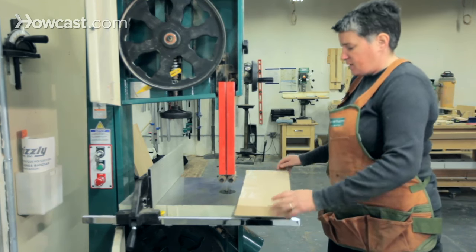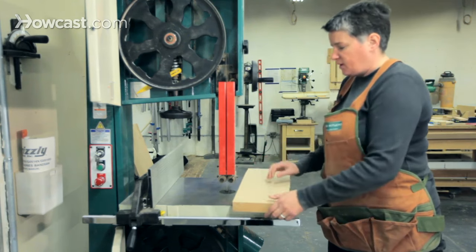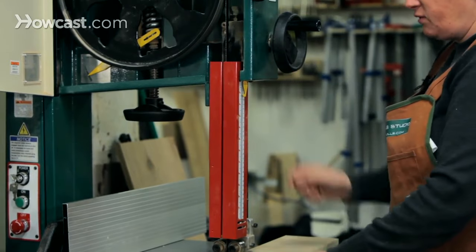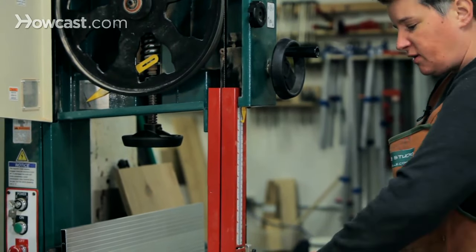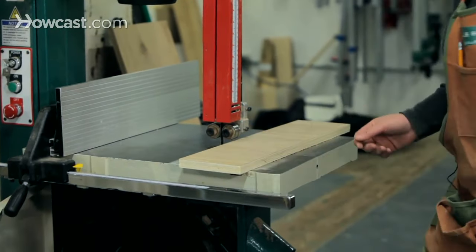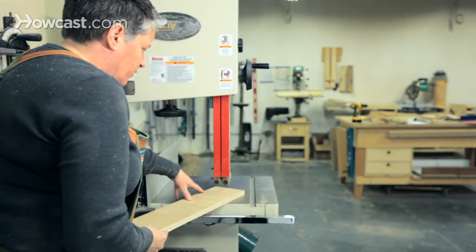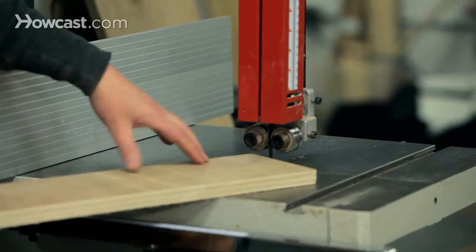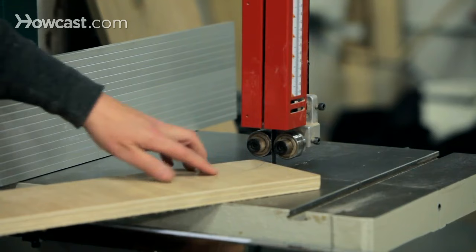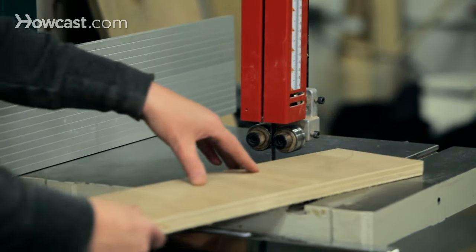What I'm going to show you now is how to cut a curve in a piece of wood by free-handing it. If we were making a template out of this, one thing I would do is cut slightly outside the line and then sand it down to make it perfect. Whenever you start a cut, you don't want to be making contact with the saw when you turn it on. I'll turn it on and then slowly feed the wood into the blade, steering the wood from behind as I push it through to follow the line.